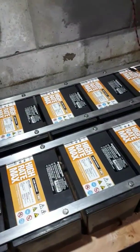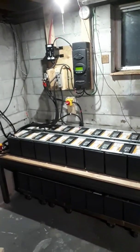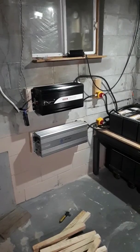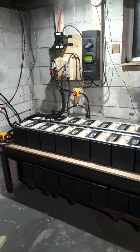These guys here haven't been charged since Christmas — this top row — and they're sitting at 12.77 volts. This is what we've got on the charge controller: pretty much 52 volts. So it's an 800 amp-hour battery bank, 80 amp charger, and 11,000 watts of 120-volt power. I can pull in about 76 amps in the best conditions when I'm floating. Pretty good.